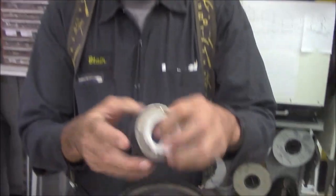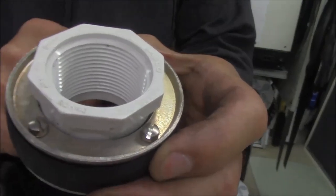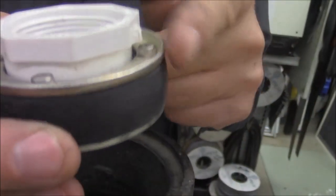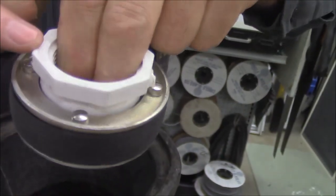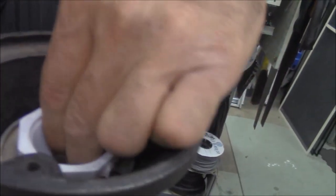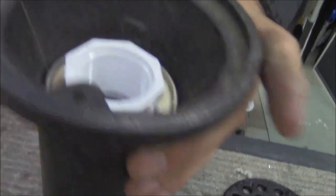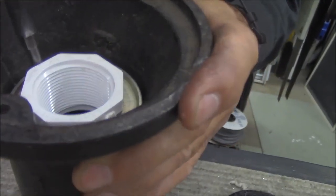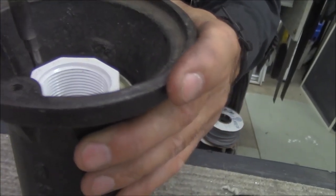What we have is a standpipe. What this is, is a rubber doughnut. It's got 4 screws, and when you tighten the screws, you can probably see the doughnut bulging a little bit. We take the doughnut — this is a PVC insert adapter, 1¼ by 1½ — and we put it in the floor drain. I pre-tighten the screws to get a snug fit before I start. Then you take the screwdriver, tighten all four screws equally, and that doughnut is going to expand and give us a watertight seal.